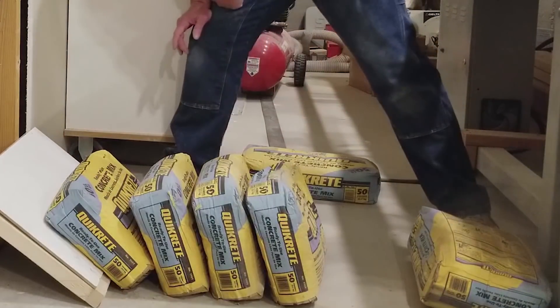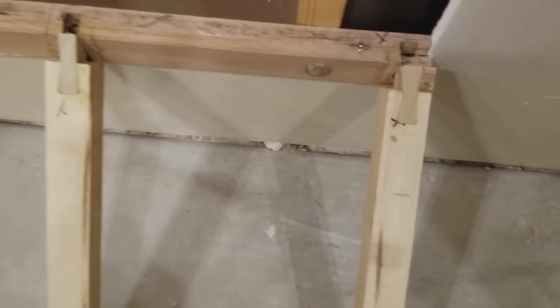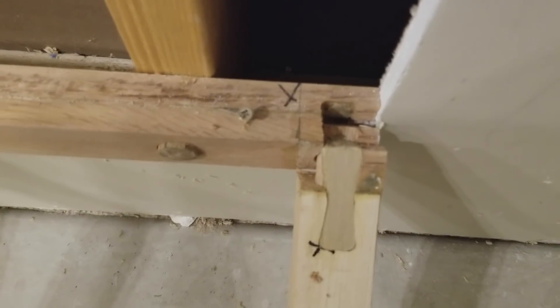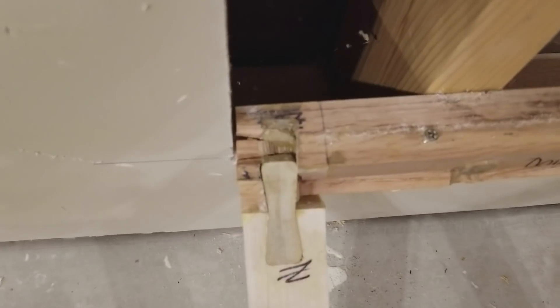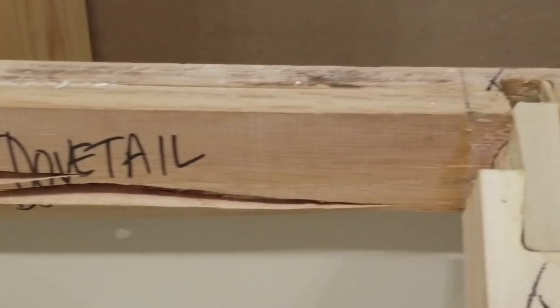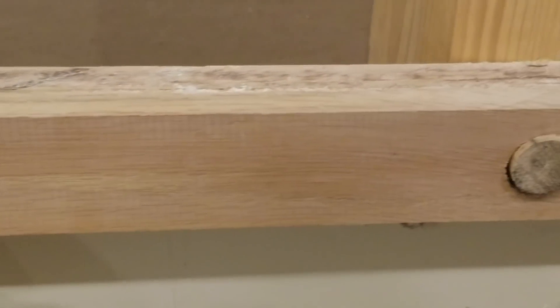At 250 pounds — there we go. It looks like the dovetails pulled out and maybe even the dowels themselves broke through the oak in the back. The lower half of the oak back support bracket split away at the point where the dowels go into the studs, and the dowels in the studs and back support appear not to be damaged at all.